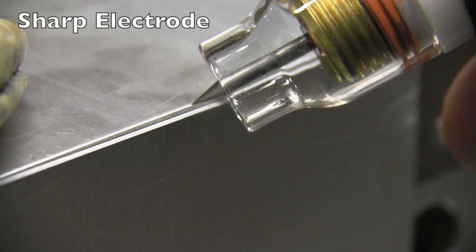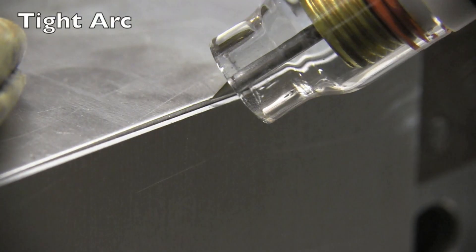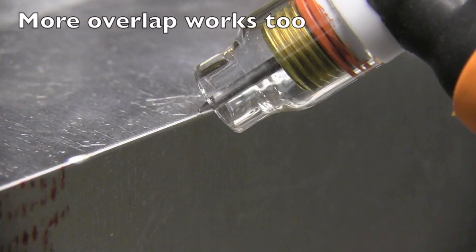Second thing: use a sharpened electrode, just about like you would for welding steel or stainless steel. That way it lights up at really low amperage without wandering and burning a corner off — it works really well. You light up low, get a nice low startup, then just bump the pedal really quickly until you see things fuse together, and then get off of it. That's basically it.